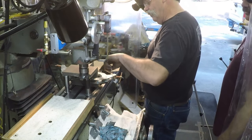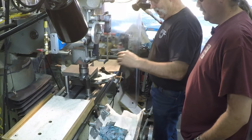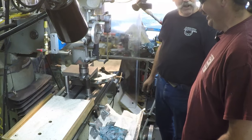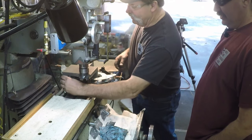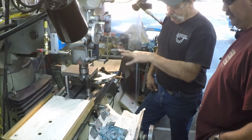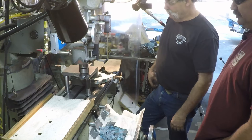We flipped it over here, took our aluminum rods out, and with our one milled surface up against the block, we checked with levels to see if it's close. It only took us about three tries to come up with the right setup. The jacks give us some tension and it's working really well - we're not getting any vibration. I'm going to have to make myself some of them. Having stuff that bolts to the table - these are kind of big, they're for taller things, but they do work.